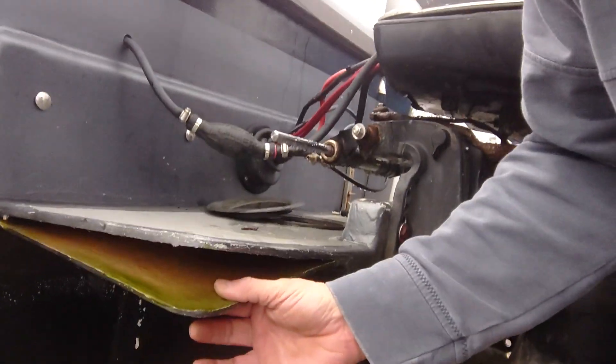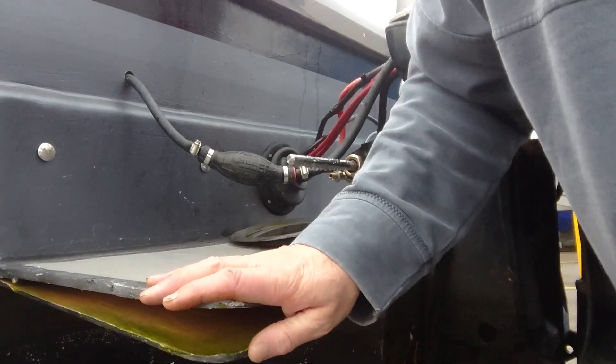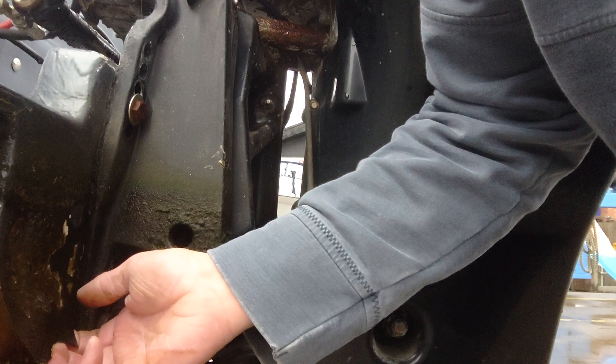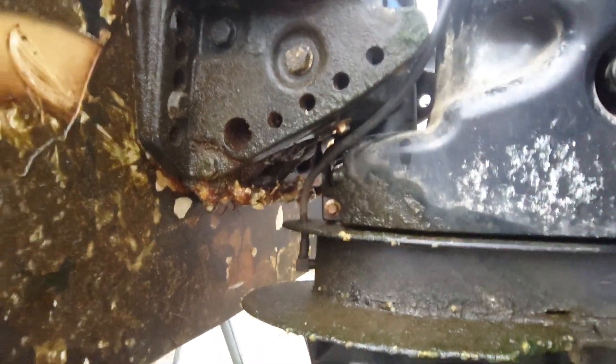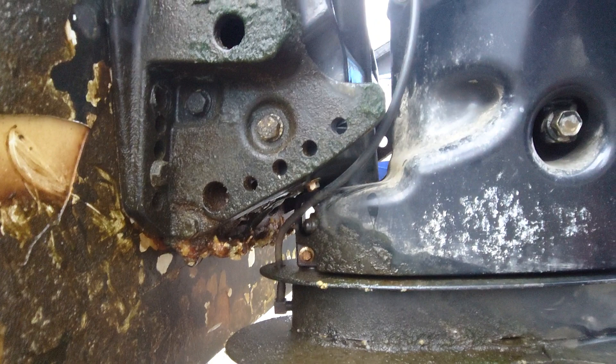What I'm going to show you here is not very old in the sense of the pod arrangement that's been designed for this outboard, but in a very short space of time, as you can see here, all the materials used were not suitable and have already started to de-laminate. The outboard pod is basically fiberglass and it's been foam filled, and it's even softened up here so that when I put some weight on the engine, you may just be able to start seeing that hull flexing. So you can imagine that at sea, what's happening to this loading through the boat.